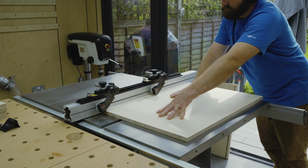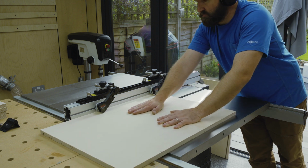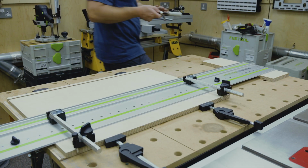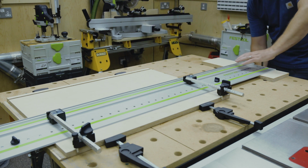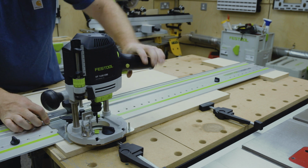Here I used the same flat top ripping blade and did 4 overlapping passes on each board. For the drawer slide fixing, I'm using the 32mm system, where this build was a good opportunity to try out my Festool Sys-AZ for the first time.